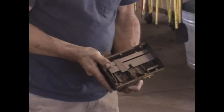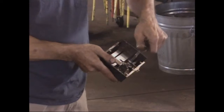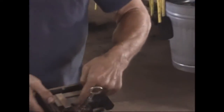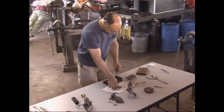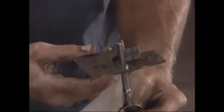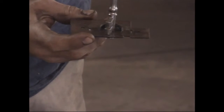It has the dead bolt, the one that's operated by the key. And in an English lock, the key operates from both sides. So it has to be a symmetric pattern. Right. So this ward, called a bridge ward, is exactly in the middle between the cover and the outer plates. And that's why there might be only a single ward on the cover, but let's see if we can put this where the camera can see it. So there's only one ward in the cover plate, but the key has to be able to work this way too.